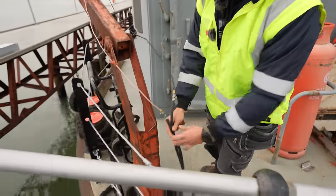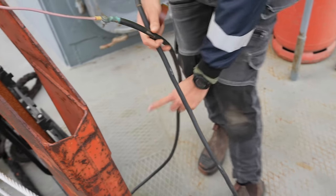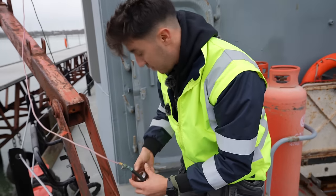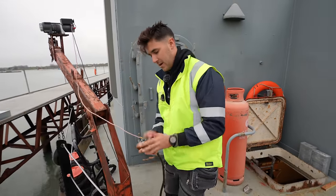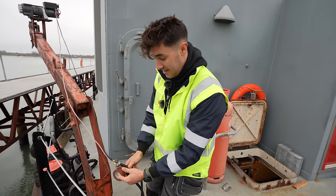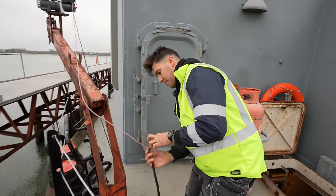So this is the crane here. As you can see, these are the terminals — the connections we're dealing with. That water has managed to capillary through there, all the way down, round this cable, up over that and hockey stick down across and round into the hole. We actually really want to use this crane. However, this was connected directly onto the battery system. So one stormy day, if them two closed in, that would have been an almighty bang — you would have had the full discharge of all those lead acid batteries. If we can tape it up, at least just use it temporarily.